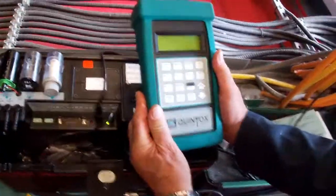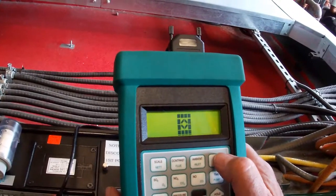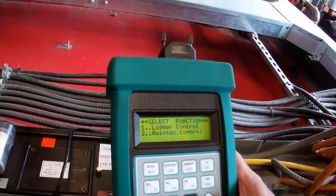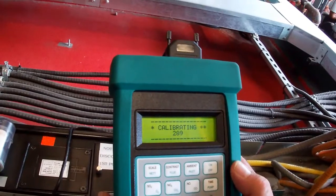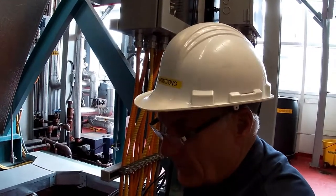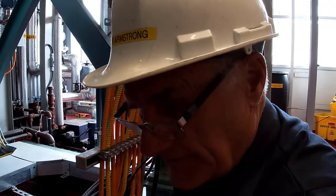I'm going to turn it off and then back on again. I heard it come on, and I go down and select Quintox Control, hit the enter button, and away it goes for 300 seconds doing a calibration. It calibrates the O2 cell to 20.9%, the carbon monoxide cell to zero, the NO cell to zero, the NO2 cell to zero, and the SO2 cell to zero.